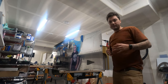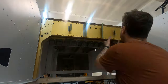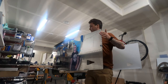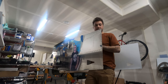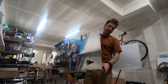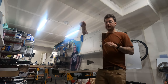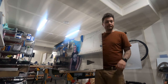I'm gonna continue working through this thing. We got the forward part of, I think it's 704 in with the spacers in between there. And so I think from here, we're gonna start to assemble the forward fuselage, including riveting some pieces together as they go in. Before that, I'm gonna prep a little bit of this very leading edge to make sure it has a decent surface to mate to the firewall, where there will be some firewall sealant at a later date.